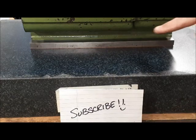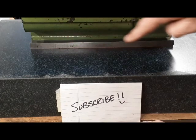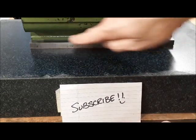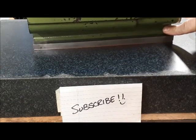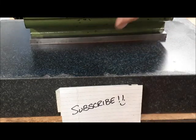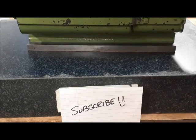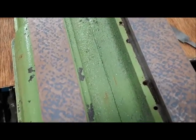One of the other things that's a good indicator of how flat a surface is getting is when you pivot, it's not pivoting at either end or in the center — it's usually about a 70-30 split. It's looking pretty good. Get this blued up, we'll see what we got. This will probably be my last cycle here, it's looking really good.